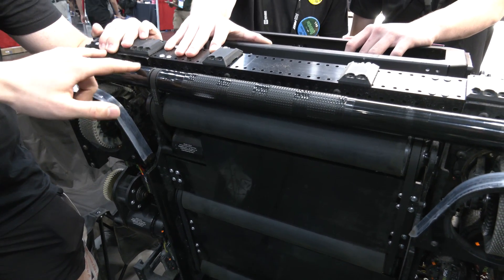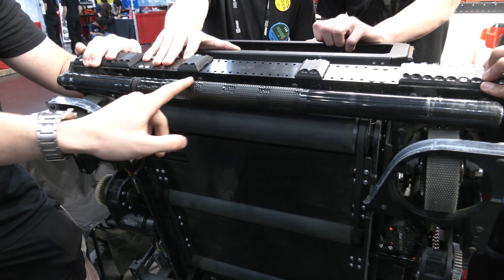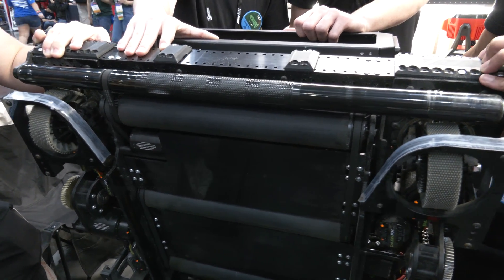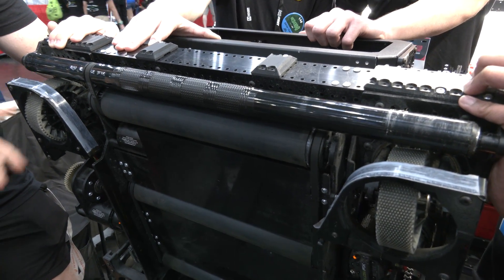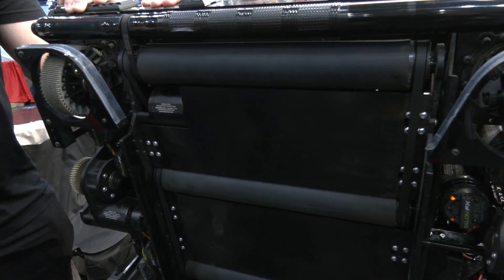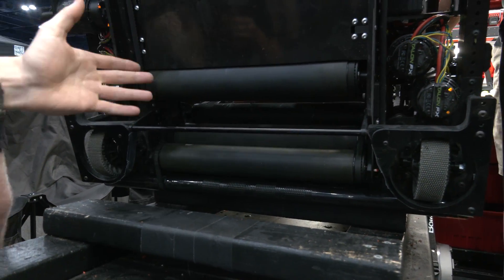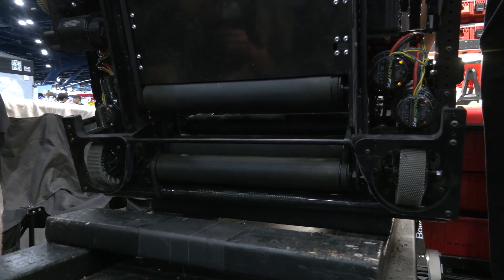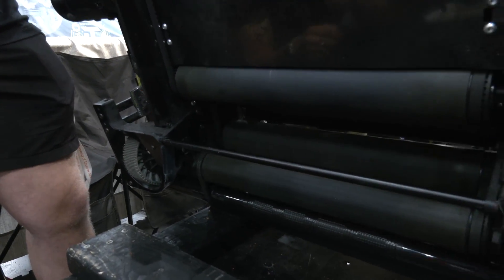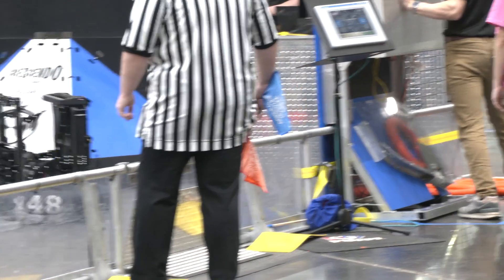We have a completely full-width front intake roller — simply polycarbonate rollers with a cat-tongue strip on the very front for extra grip in the middle. We used polycarbonate for a lower coefficient of friction so notes can actually strafe along the edges down the sides of our swerve module shields, then maneuver into our two-inch rubber rollers — the Vex custom-made rollers — that feed down into the indexer mechanism. Both sides of the intake run independently with a speed differential so notes get kicked up efficiently.